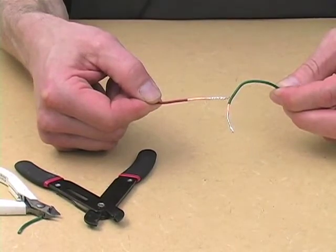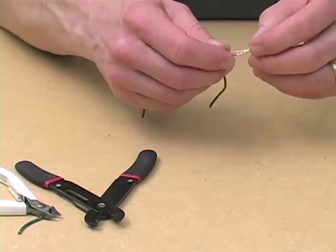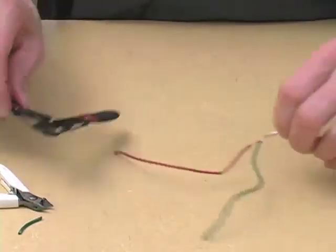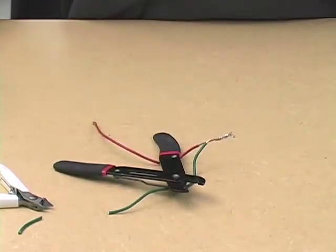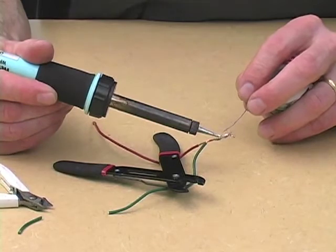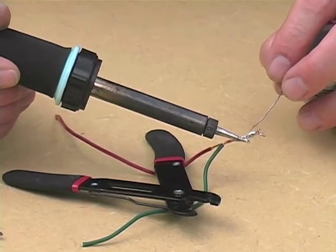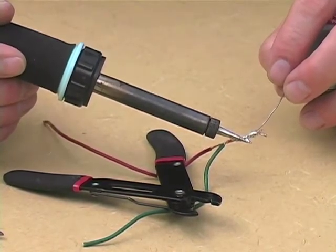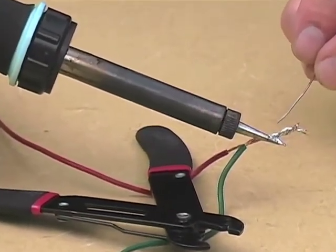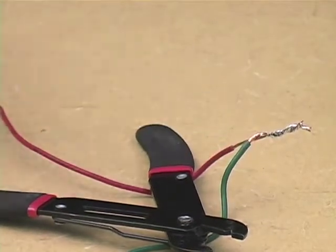Then we wait a moment for them to cool down, and we twist the wires together like this. When it's twisted so that there's some mechanical linkage between them, we do one more pressing of the solder against the wire through the blob of solder. The solder that was already on the wire should melt, and between the two wires it should co-mingle to form a solid joint.